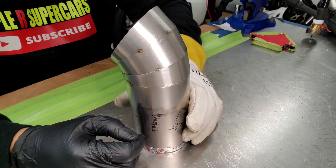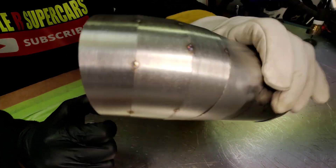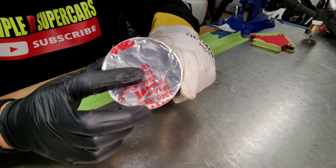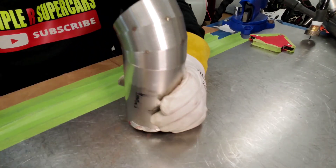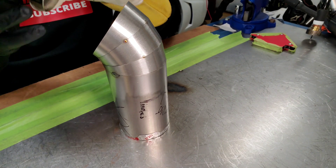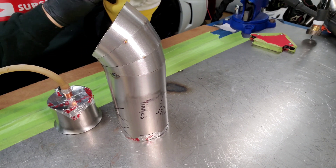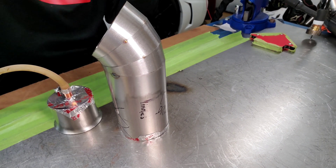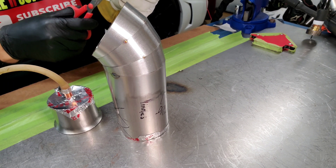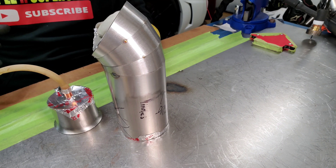Now that I've got my pie cuts put together, tack welded in place, I'm completely happy with it. The seams are made up really nice and tight — that's what you want to do. I have some heat tape up here, there's a pinhole for my vent. Go on to back purge. If you don't have a back purge set up at home, I suggest you get one, make one, whatever you've got to do, but get that gas flowing through the inside of your beads or your project so that contaminants don't surface through.